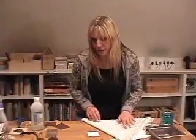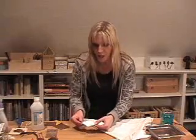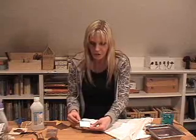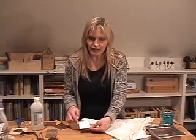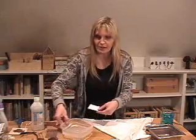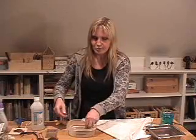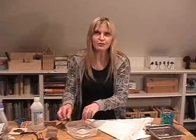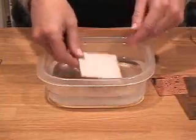After the metal has cooled, you can remove the paper. Make sure you look at it and check that you have no ripples in the paper — if you do, iron it again to make sure the paper is flat. On areas where you don't have an image, you will see the paper buckle a little bit, but that's okay because that's where the toner is not. To remove the paper, soak it in water for about 10 minutes — just place it in water after it's cool.